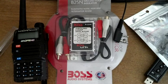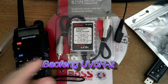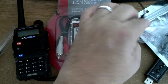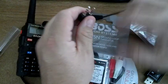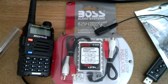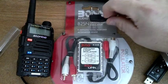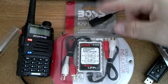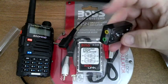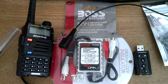In this case, we're going to wire up an audio cable to the Baofeng V5 — I'll link the radio at the bottom. The problem is, the way the Baofeng V5 is made, when the push-to-talk is activated, it's caused by closing a ground-loop circuit between the mic and the speaker. If you just wire it straight across and plug it into your radio, this USB sound card I'm going to use will key up the radio and keep it keyed up, because it's got a common ground in there.